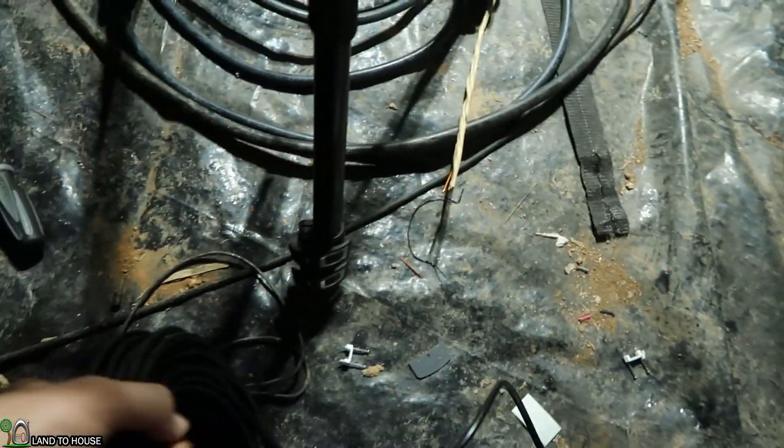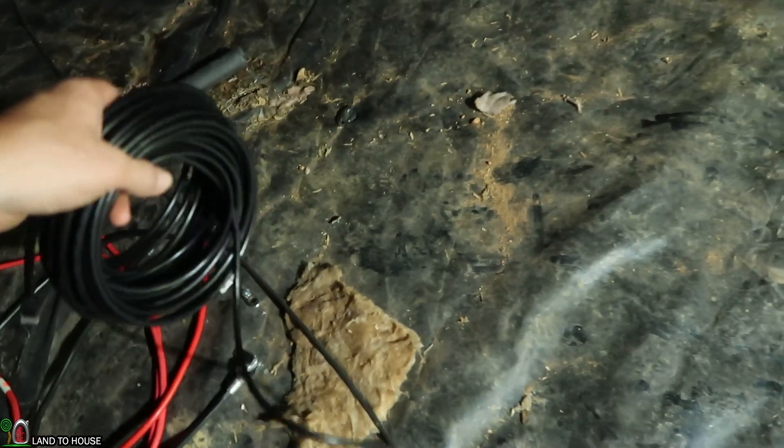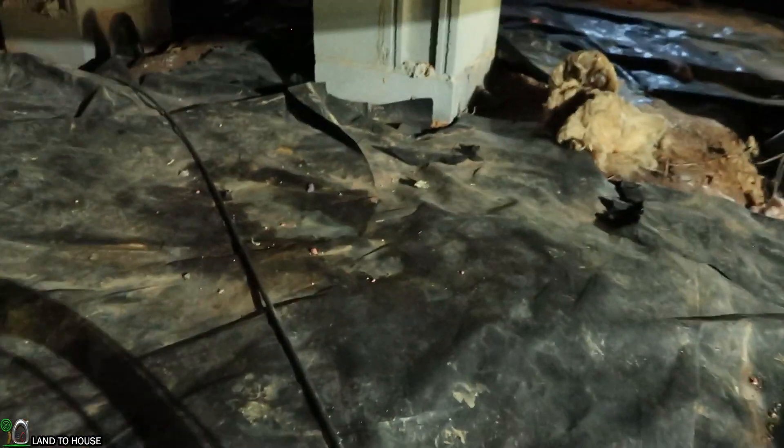The Wi-Fi router is in my office which follows this cable here. I'm just going to follow along with this new Cat 6 cable and bring it over in here because this goes straight up through my floor into the office space. It's kind of cramped quarters. Right up here is where this goes into the house, so I may have to drill another small hole next to it from upstairs and get this new Cat 6 cable through there.